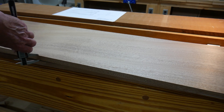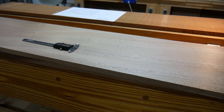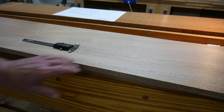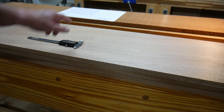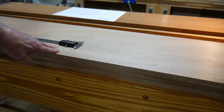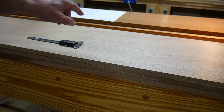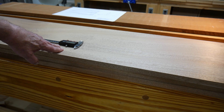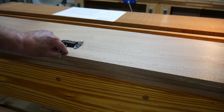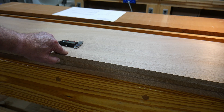So take this thing off before it falls. Now the next thing will be to start sizing this stuff. I've got straight edges — one true edge on this one edge, the far edge isn't. So the first thing I'll do is run this through the table saw, this edge against the rip fence, and I'll take off just as much as I have to from that very far side to true it up. Then I'll move the rip fence over just a little bit and take a pass off this side too, because that saw blade is absolutely true. So that's where we're going next.